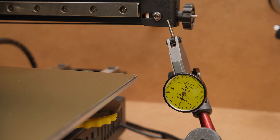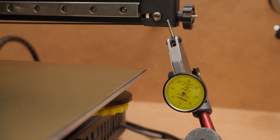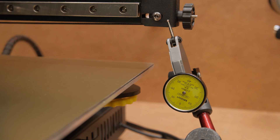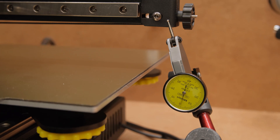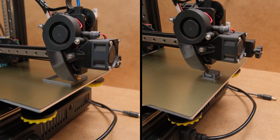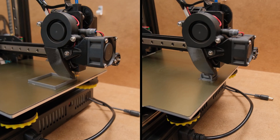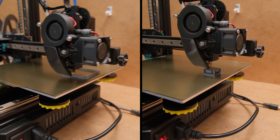The real enemy of X-axis wobble is the heat bed. As it has significant weight, the higher the accelerations, the more inertia it will have, and all those vibrations will be transferred to the whole frame, introducing wobble of the X-axis. So because the wobble will be highest the further along the axis you go, that is the reason I made my prints on the right edge to see the worst-case scenario. Plus, this is a direct drive printhead that has way more mass compared to a Bowden setup, so I was expecting quite poor results.